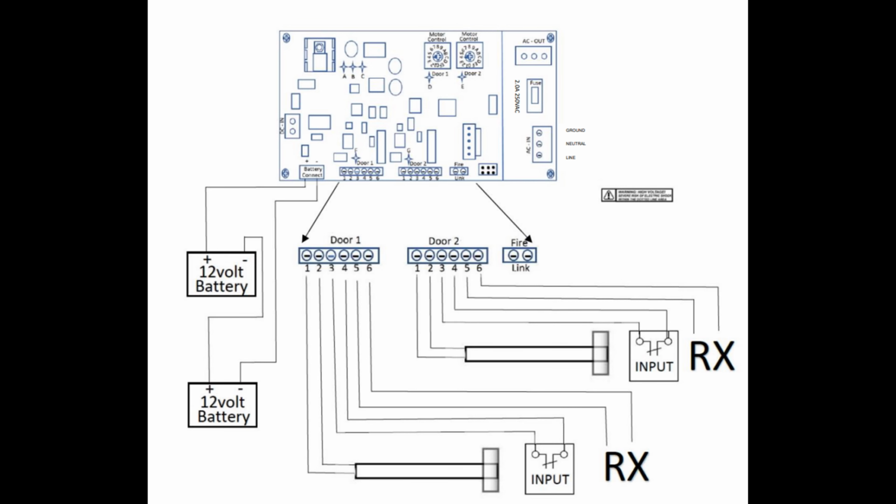When you increase the setting on the potentiometer, you're increasing it by 50 steps. At full draw, while a motor is running on startup, it should only see 1.5 amp. But the bottom line is the motor control is what controls how far that goes. It's not controlling amperage. It's controlling the travel of the worm screw.